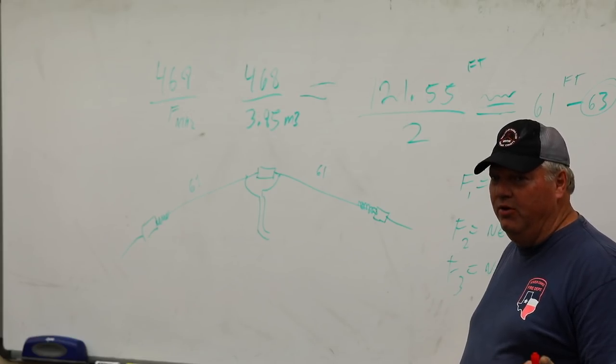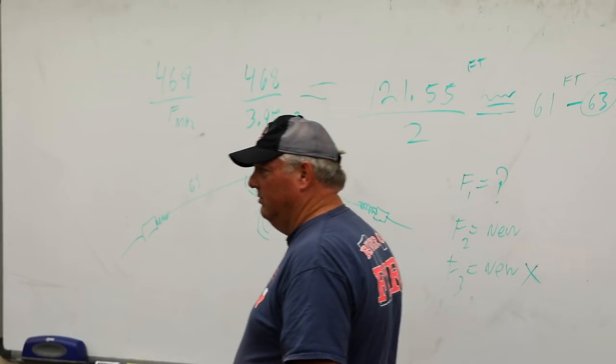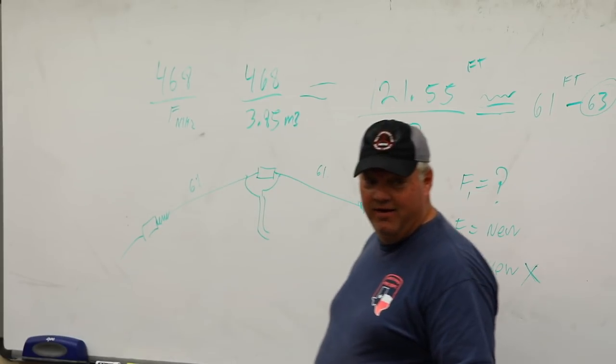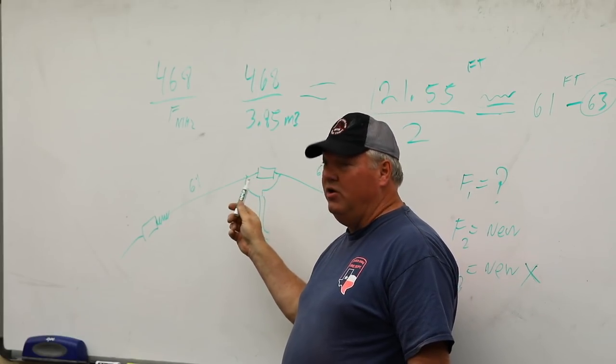What's the main problem with aluminum wire? Corrosion. Oxidation. Yes, between what? Dissimilar metals. Different types of wire. Exactly, and where's that going to be? At the joint of the connection. So you've got to worry about your dissimilar metals. Aluminum, you can use that.